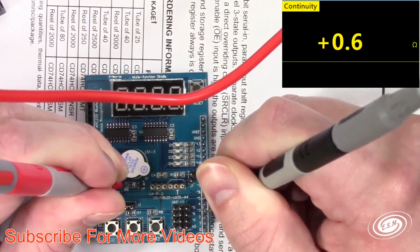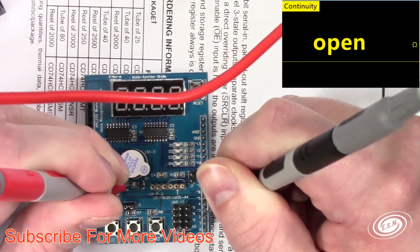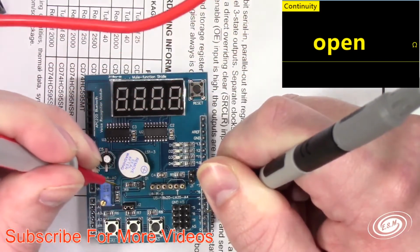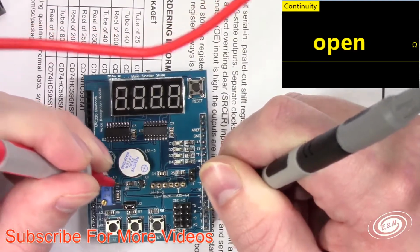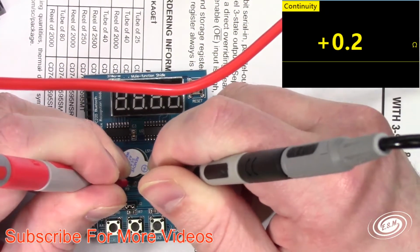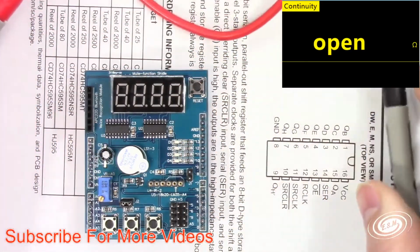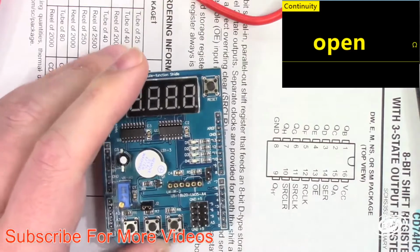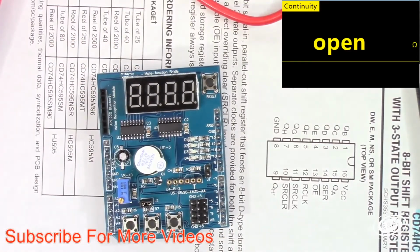So pin 3 goes to this resistor here, and if I put it right here, this is not going to give me a resistance value. Where does that resistor go? Yeah, it goes to the other end of this MOSFET, so it's probably sending a pulse width modulation signal to the buzzer, so pin 3 goes to the buzzer. And that was the last pin that we had to figure out, so that's it, we did it.